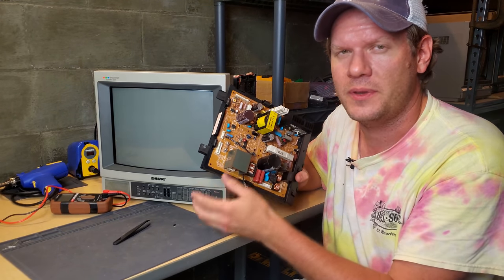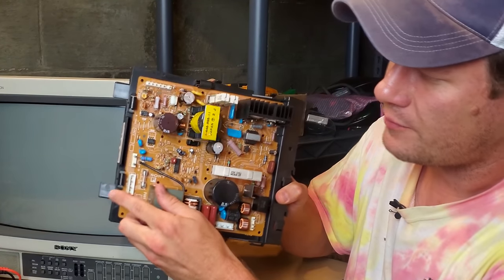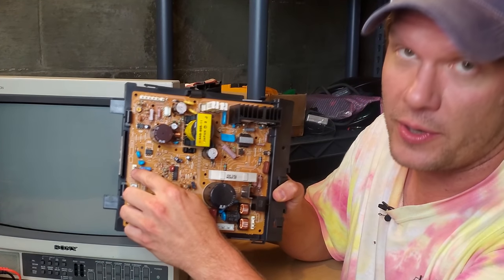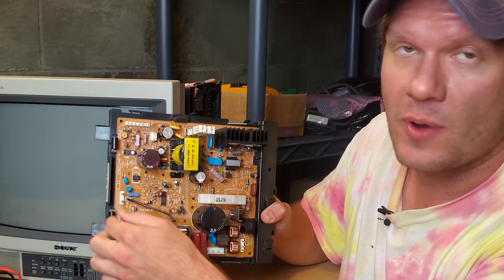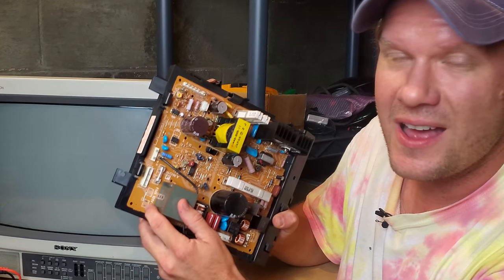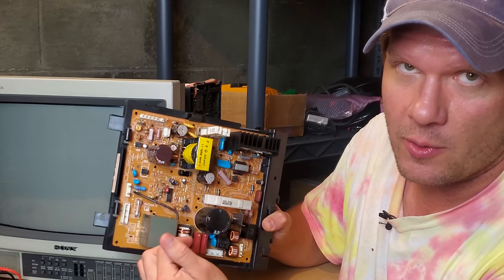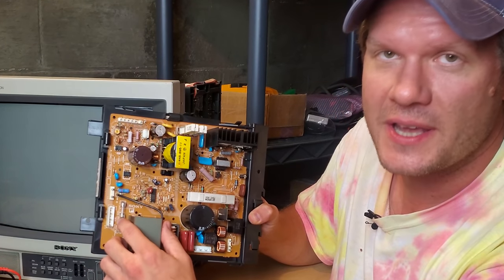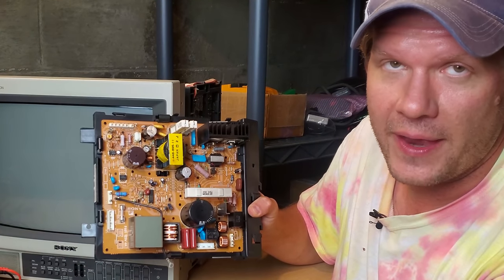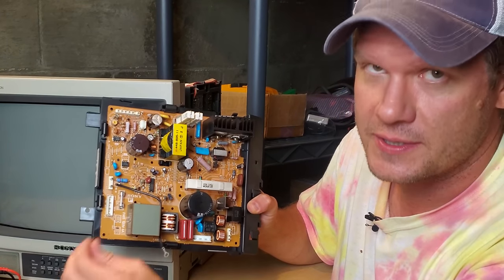This is the F board on the Sony PVM 1343MD. There is a connection point right here - this is where our main AC current comes from the wall. It goes into this. The connection point next to it is a ground point, and that helps ground out the monitor. Our AC power goes in, and we have an empty slot where there could be a fuse, but it's not down here. We do have a fuse on this other line where the power comes in - that's our first fuse. It's a pretty standard fuse. You can actually visibly see if this is blown pretty easily because there's a nice wire there, and if you don't see the wire, then that is blown. But we're going to go through and test the fuses in a second.